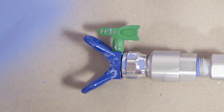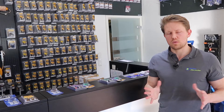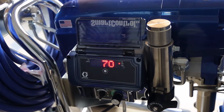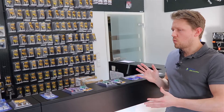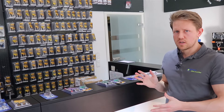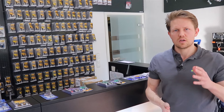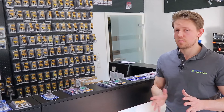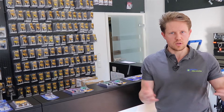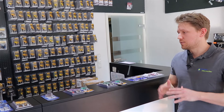There is a lot of debate online about the correct pressure to use depending on the spray tip. For low pressure tips, we work between 800 to 1100 PSI, which is about 55 to 76 bar — that's a comfortable optimal range for low pressure tips. For the wide range of other tips and materials, giving a definitive optimal pressure is very difficult. You'd have to look at the recommendations for your sprayer and your material, or give us a call and we can help.